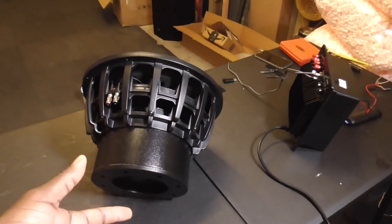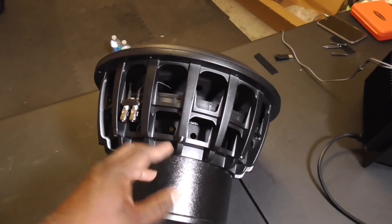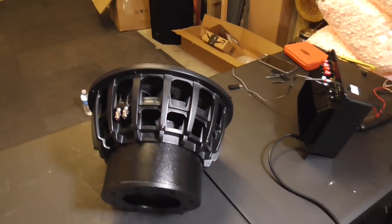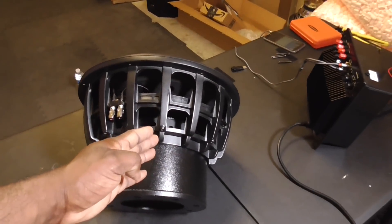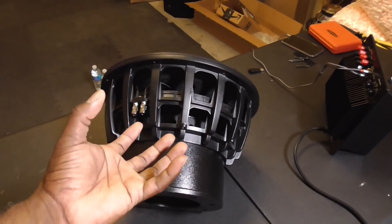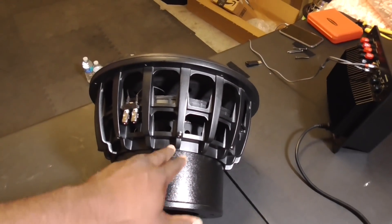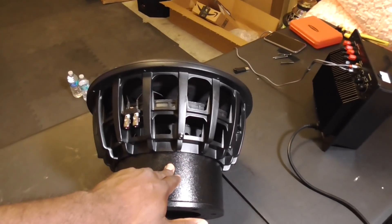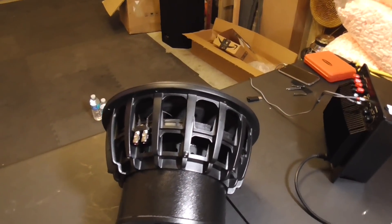A lot of people may ask why I'm only putting 800 watts through something rated for nearly five times that. The reason is I believe in a ported enclosure 800 watts on this thing will sound damn good. Also, this woofer is optimized for small enclosures — with all that BL and that large voice coil, this thing is going to slam. Traditional 15-inch woofers have a three to four-inch voice coil; this has a seven-and-a-half-inch, so it doesn't need a lot of volume to produce great sound.